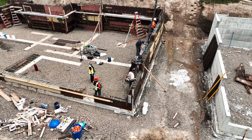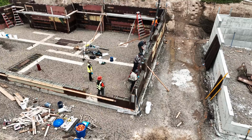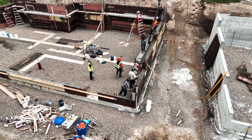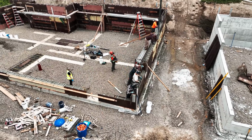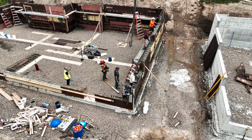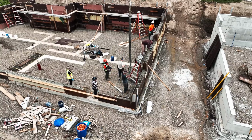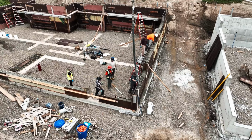And then at the bottom right, you'll see here in just a minute or so that that's just the nature of it. So we try to leave a hole or a low spot so that whatever pushes up at the bottom of the step, we're just going to lift out by hand and fill it in. So it's a little bit of a judgment call as you go, depending on the heat, depending on the slump of the concrete and timing. Sometimes we just fill them and then let the pump guy go on his way, and then we hand fill them, just that last little bit.